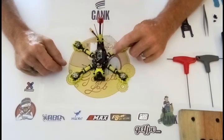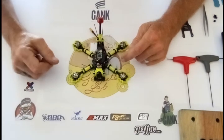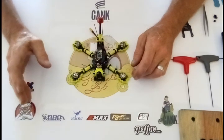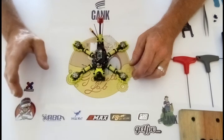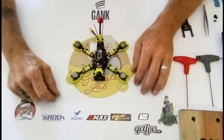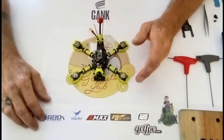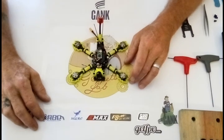The next thing to mention is that I installed the VTX table via the CLI tab in Betaflight, did the save and reboot and everything, and I fly Fat Shark. So I set for Fat Shark, channel 5, 500 milliwatt, and so on. Save and reboot, it did its thing. I plugged in a LiPo, and lo and behold, it's at Boscam A.